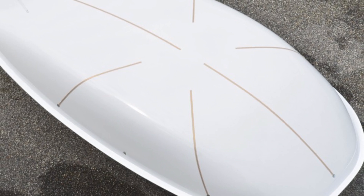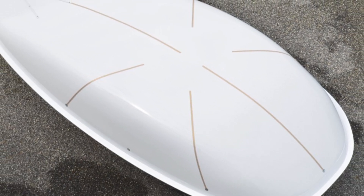The second most common problem is how to install the lightning protection system on the outside of the radome. Like, what do I need to do? Do I need to seal the edges? Do I paint over the thing? What does that look like? We can walk our design engineers — the customers we work with — through that very specifically. But a simple answer goes like this: don't paint over strike tape. Don't paint over metal bars if you can avoid it. It does cause some minimal degradation and it doesn't look good over time.